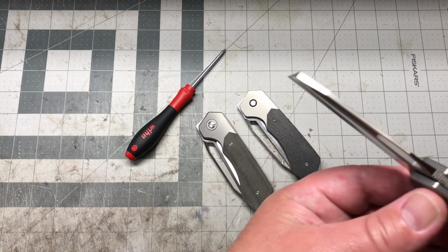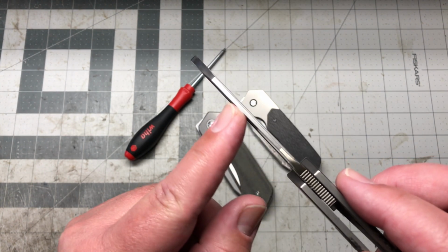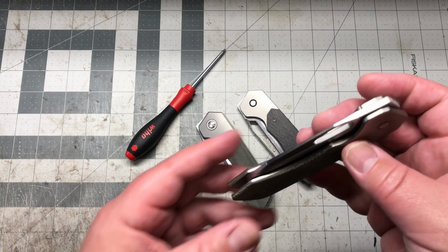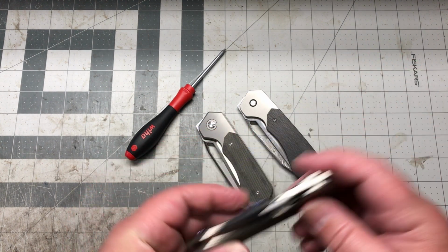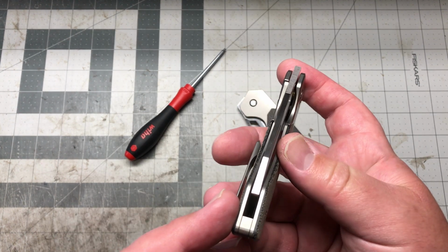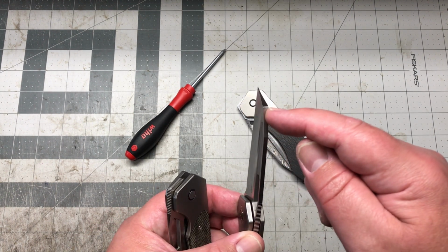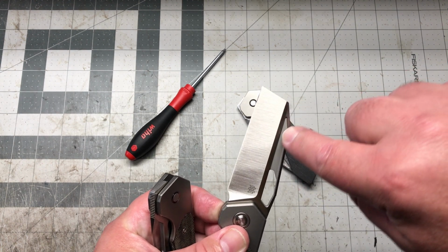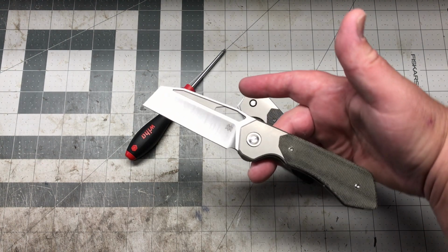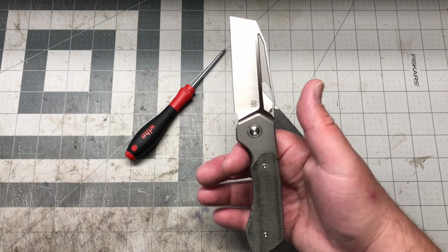They did the really narrow job on this spine right here. I thought it was another thing I first noticed. I was like, oh man, that's really narrow. And so I knew I wanted that chunkier. I wanted a nice 3 mil just all the way across. The idea of the blade was for sure to have it get fatter right here, to keep a lot of weight super centered and nice on the knife. I talked about that centering earlier. Like, that thing is balanced right there, right? Right where you're going to be gripping it, it's balanced, perfect.